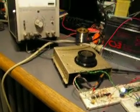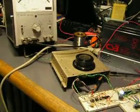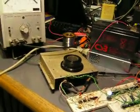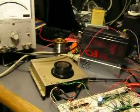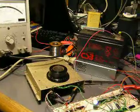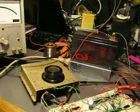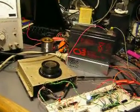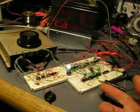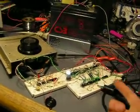For today's project I've got a digitizer knob out of a Sony Type-C video machine. This is a nice device because you can use it in just about any project where you need precise control over some electronic or digital value using a knob. It's sort of arbitrary what you can make it do — I'm controlling counters which control a digital-to-analog converter, so I've made a variable power supply.